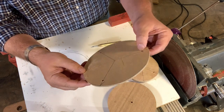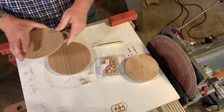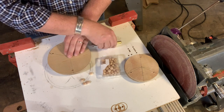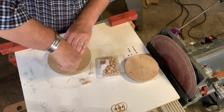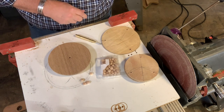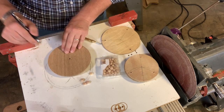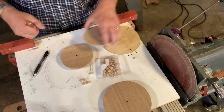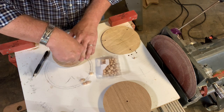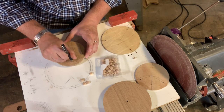I'll drill a small hole for my punch. Still working with twist bits — I've got some nice tear out. Looks like 5/8 of an inch is about the perfect position for those. So now I'm just going to lay this on here, orient it looking at the grain, and put the punch in. Push down. And then while I'm here, while it's fresh, I'm going to go ahead and highlight those dimples — they're pretty good, but just a good habit to get into. Same thing here — there's my grain direction. We'll make sure one of those holes is at 12 o'clock, and then we'll go around the clock. And that's where we're going to drill.